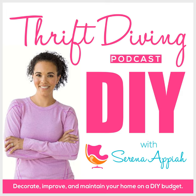That's why I was so close to skipping the podcast today. But anyway — if you have metal cabinets or metal furniture with some light rust, you can easily paint over it. Just make sure you're using the right products and going through the preparation steps so you get the best results and it doesn't continue to rust. Use a rust dissolver, then a metal primer — either clean or dirty — and then whatever paint you want. If it's going outdoors, use Rust-Oleum's Stops Rust spray paint.